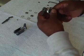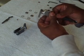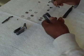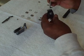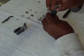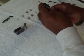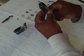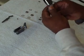I spun it around there a good dozen times, put a little pressure on the blade grips itself, spun it around, like I say, a good dozen times, took it out, and as you can see now, the shaft with the thrust bearing assembly in place there is not bolted on. Just wanted to see how it would rotate with the sanding done. Now you can see it readily goes into place. No sticking, no binding. So it looks like that did the job.